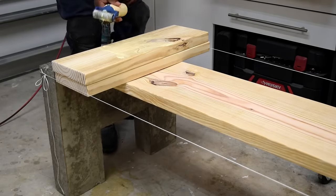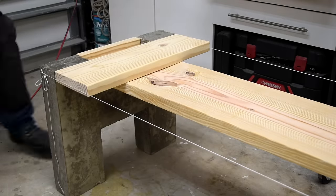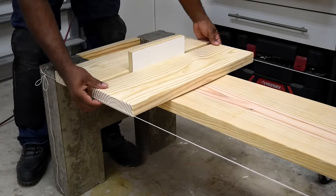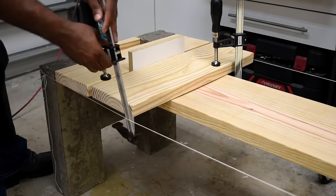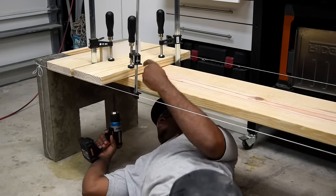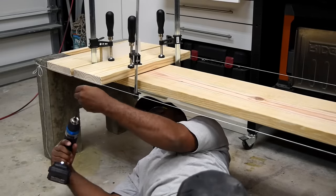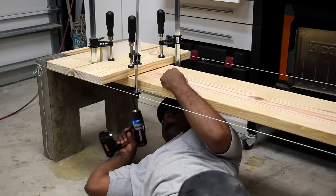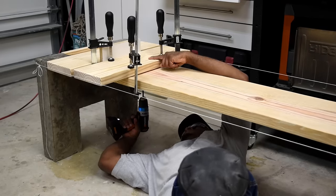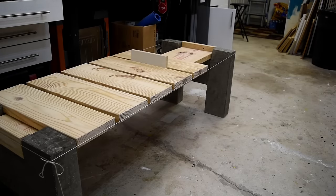The two lumber pieces on the outermost of the bench will never be glued, because those need to stay removable. For the remainder of the board, we can add wood glue, and now I'm going to take clamps to clamp those into place, slide under the bench, and attach a few screws from the bottom. And once the first one is done, you can take a piece of 3/4 inch board of any sort